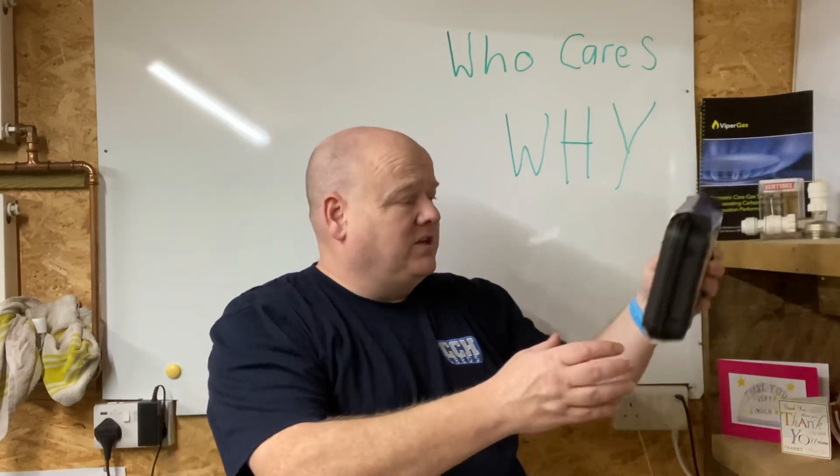Why bother? Why not just drop the water, put your boiler in and go? Well, first of all, building regs — when you sign the benchmark it asks if you flushed the system. Also important now is the new British Standard BS 7593:2019, which says that when we go and do a boiler service we test the water. That means someone could come along the next year, test the water, and know that you haven't installed the boiler correctly. It's so quick and easy to do it correctly.